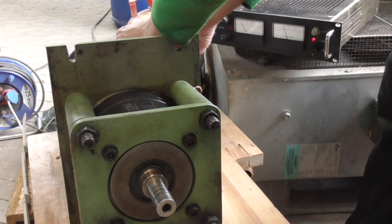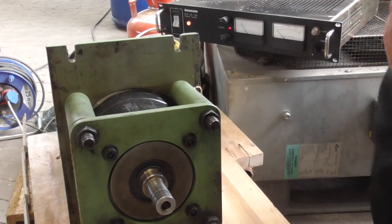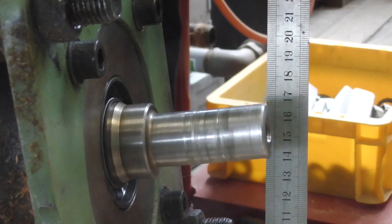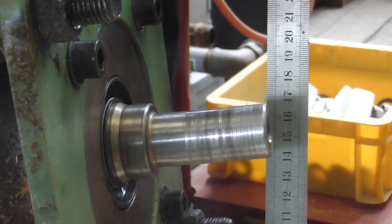So let's see how well the shaft wobbles. This servo has a brake and I didn't release it, so it will draw quite some current. Measured TIR was four and a half millimeters, so it had to be straightened before going any further.